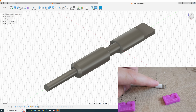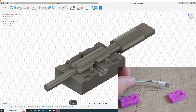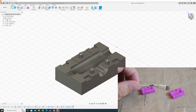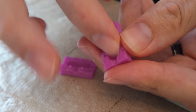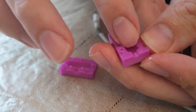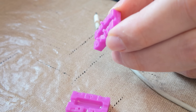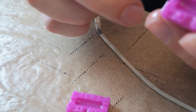I went into Fusion, modeled the iPhone cable and the repair I want to make, then made a mold of that. We're going to clamp this down and inject some glue and hopefully fix this cable so I can get a few more years out of it. I'll get a little vegetable oil on my fingers and get it into all the cracks and crevices, the side of the sprue hole, and the side of the air reliefs — same thing on this side.